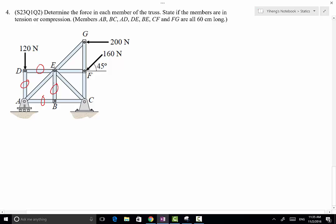These several truss members are all of the same length, therefore we can determine that all of these angles — this one, this one, et cetera — are all going to be 45 degree angles. I'm just going to write one as an example.